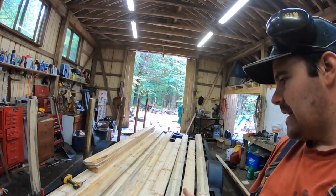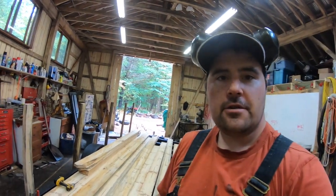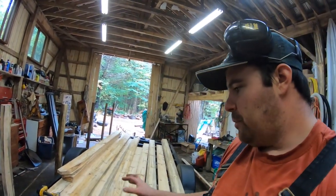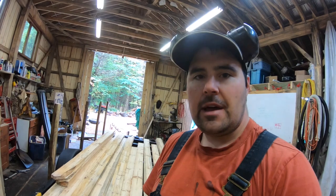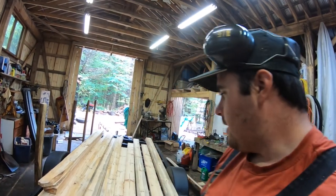What I'm trying to do today is take some wood that I've milled and lay it down as the deck. What I milled here is red pine — obviously if you've seen my other videos you know I have an abundance of that stuff. It's inch and a half by six inch. I'm going to treat it before I put it down, but I have to cut it to length first. I'll fit the pieces in, then just before attaching I'll flip it over, put a coating on the bottom, flip it back, attach it, and put the final coating on top.